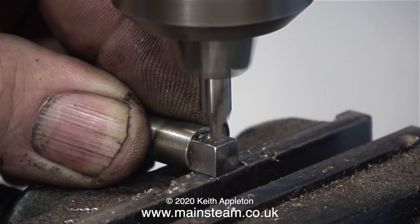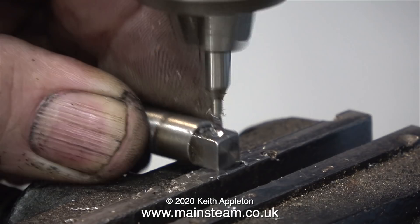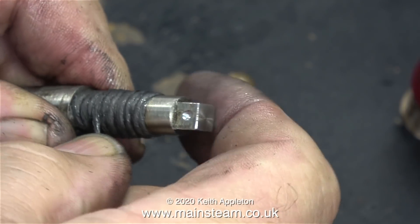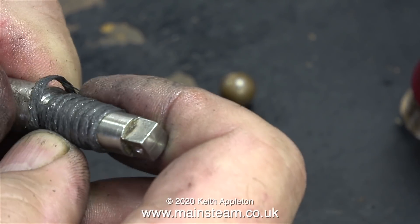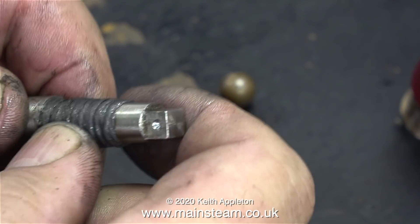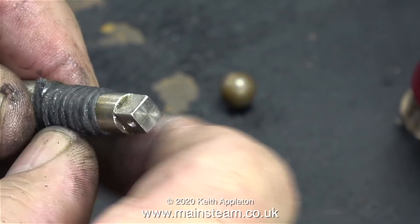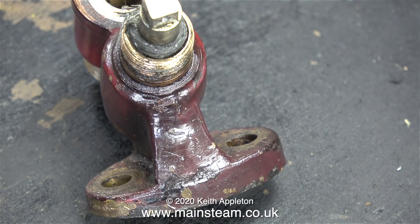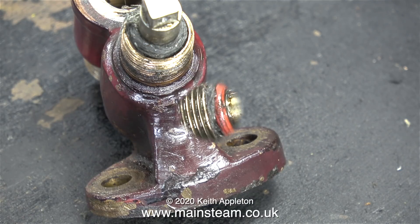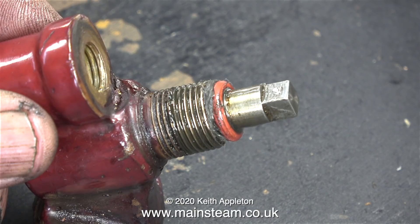Knowing whether the valve is open or shut could be a problem, so I'm making a mark using a centre drill. The valve itself is a taper plug type, and the shaft is thoroughly packed with graphite yarn. I'm using some new old-stock graphite yarn like it used to be — I don't like the modern stuff very much, it doesn't seem to be the same. I wound the yarn tightly around the shaft of the valve and refitted it in the hole. It's the pressure from the gland nut pressing down on this graphite yarn that holds the taper plug tap in position. Before refitting the gland nut I also fitted a silicone o-ring — I do like a belt and braces approach.